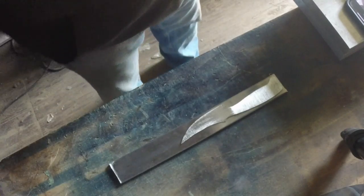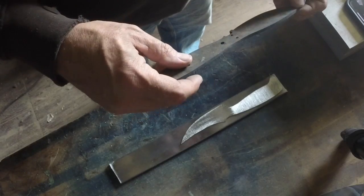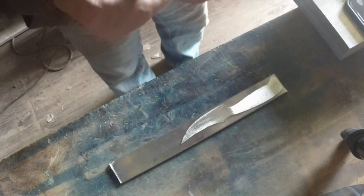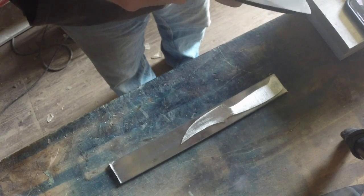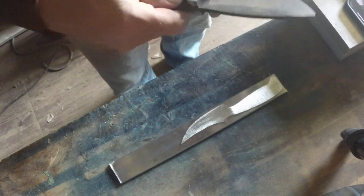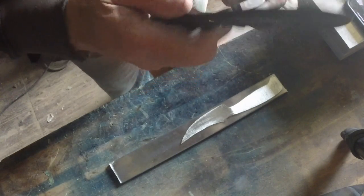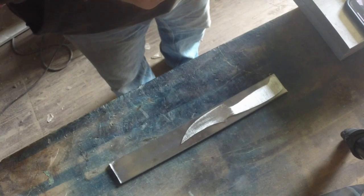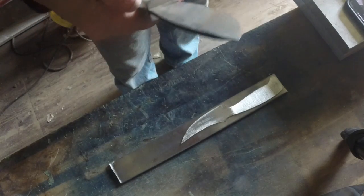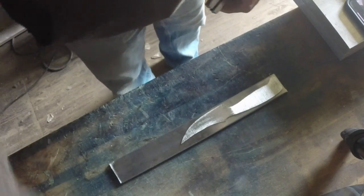And this skinning knife I had already hardened, I had to anneal so that I could drill the pinholes in it for the guard. And that guard just fits up just like that, nice and snug. Quite happy with the fit that this got. Oops, I got it backwards, let me get it around the right way, and get that pinned up once I've got this hardened, and complete that knife so I can get it delivered and paid for, and move on to some more projects.